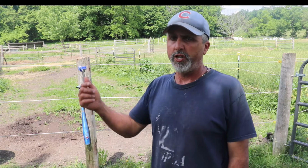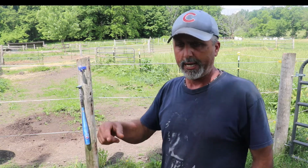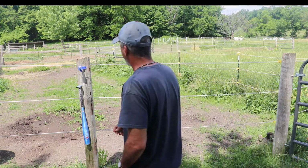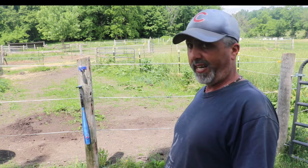But I know you want to get your one ground rod really, really deep, and you can buy those at the store. You put on a post hole pounder and just hammer them all the way in. And when you get down to the bottom, take a sledgehammer. Mine are about a foot off the ground. They sell special clamps. You run the wire off your box, you clamp it to the ground rod, and you're good to go. Plug it in, get yourself one of these things. I've got it securely mounted real nice to the fence post. It isn't going anywhere. It's got screw holes in it, or on the back side it's made to snap onto a T-post also. So anyways, that is my story.